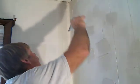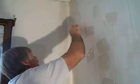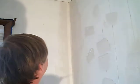That's how you put a corner bead in. I'm going to take this and bring it down so I ain't got a big line on it — kind of fix my boogers. There you go, that's how you put a corner side in. Just take your time. You'll have to come back and re-mud it and re-mud it, and then you're that much closer to getting this project done. I appreciate your time. Bye.